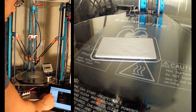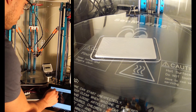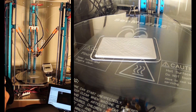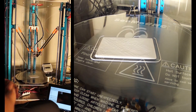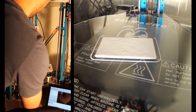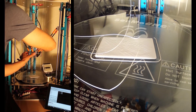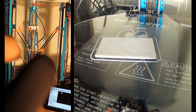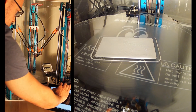After that third layer, it goes up to 150mm like I said before. Then I pause — I'm running Linux CNC, but you can pause whatever software you're using. After that, I get my black filament and change it out like you would any other time. I make sure that I actually extrude some filament in my hotend to make sure I clear out all the white, otherwise half of the letters would be white. So I just loaded the black filament and now I'm pushing some black filament through to get the remaining white filament out. Once that's done, just hit play again on Linux CNC.